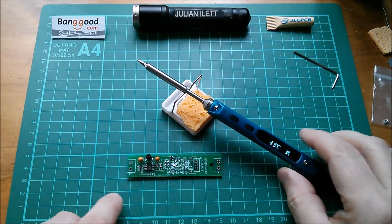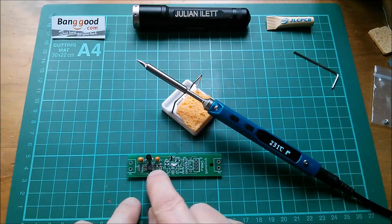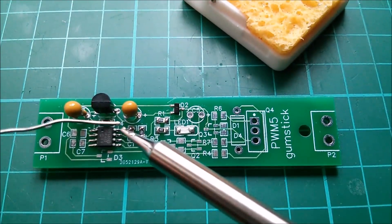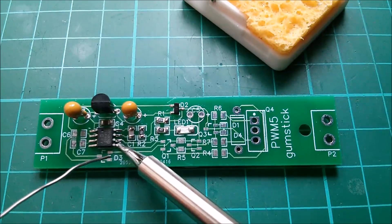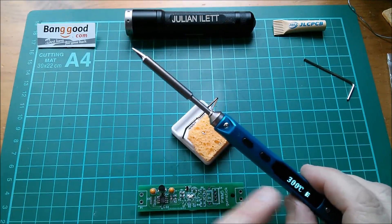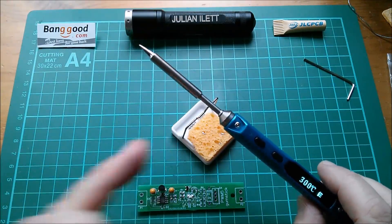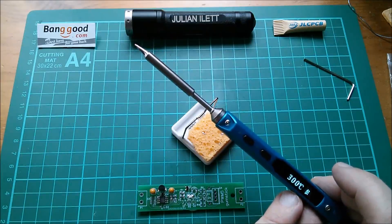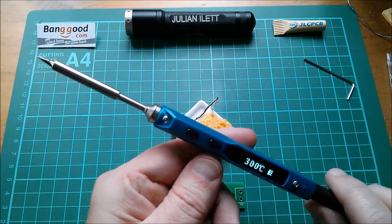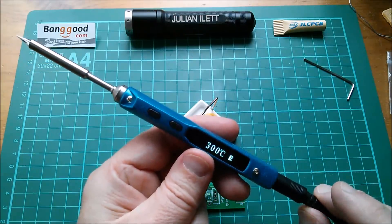Let's warm that up and start working on this eight-pin chip. I tacked that corner pin, soldered the other seven but didn't re-solder that one, so I'm just going to re-solder it now. A little bit of solder on there and just remake that joint — yes, that's nice. I've gone back up to 300 degrees actually. I found that when wiping on the sponge it was tending to take all the heat out of that very fine tip, so a little more energy is probably a good thing. Perhaps 300 as a default was the right temperature after all.